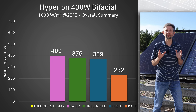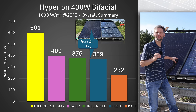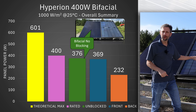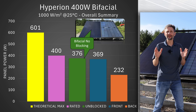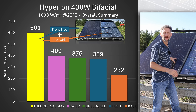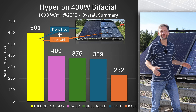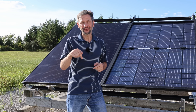This chart gives a quick look at the theoretical max output. The back by itself can produce 232 watts, and the front by itself can produce 369 watts. The front and back together with no blocking or special reflection effort on the back side is 376 watts. The rated output is 400 watts, and I suspect if you put these on an open frame with white rock under them, you'll easily hit that. Then just for fun, if we could somehow shine the full power of the sun on both the front and the back at the same time, the max theoretical output would be just over 600 watts. Future Dave needs to come up with a way to test that theory — the challenge is getting both sides exposed to the full ratings of the sun at the same time. Maybe you have some good ideas of how to do that — you can leave them in the comments below.